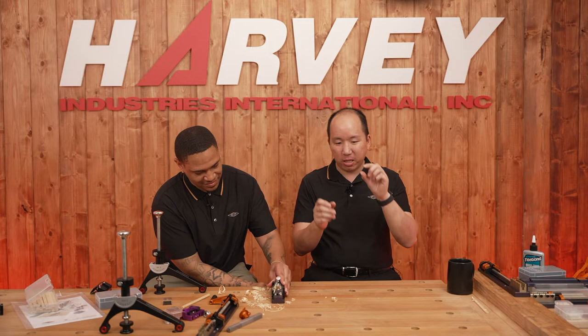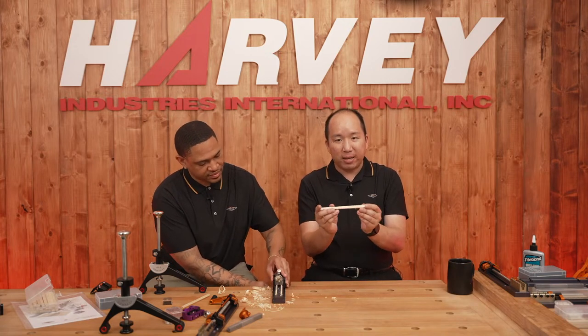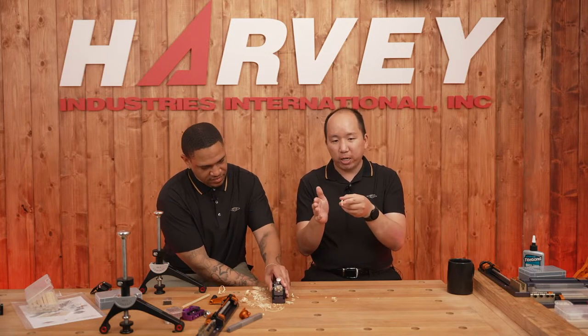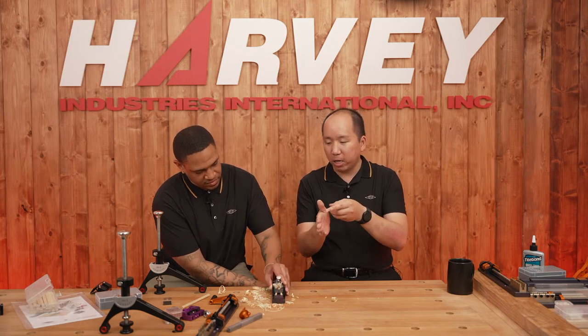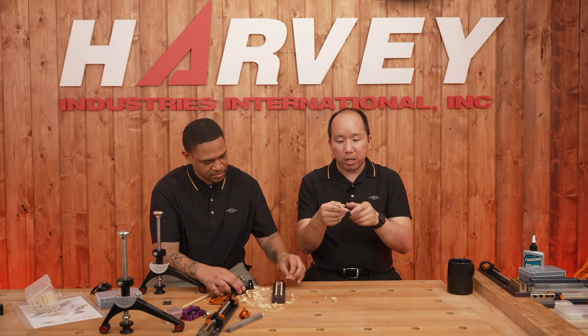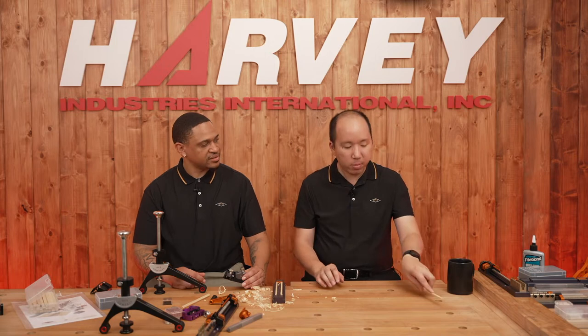It is a very specific size, like I mentioned earlier in the stream. 4.3 millimeters in thickness, 9.25 millimeters in width, and 170 millimeters in length. If you have the kit and the blanks, bring it up and set it against the fence of, let's say, a table saw, and you can match it up and set everything correctly. You can cut a bunch of these strips and have them ready. The width and the length are what is critical, but the thickness doesn't really matter because you can plane the thickness down. Nice, so that answers that question.